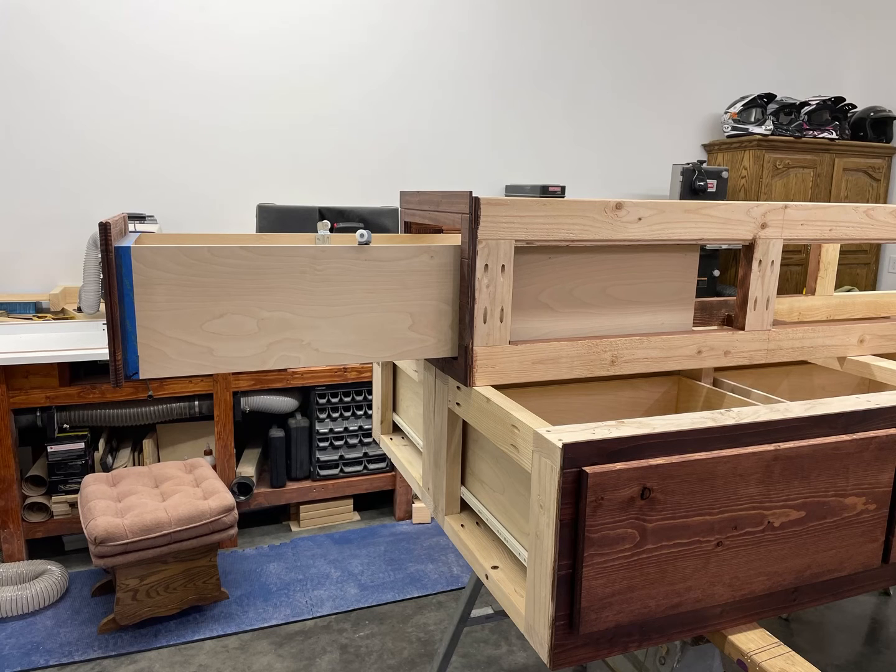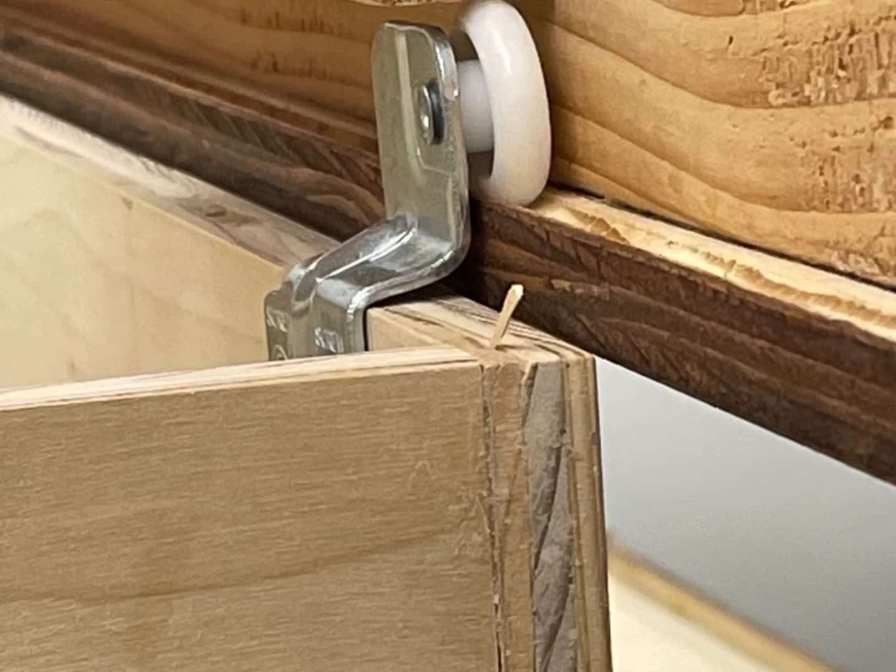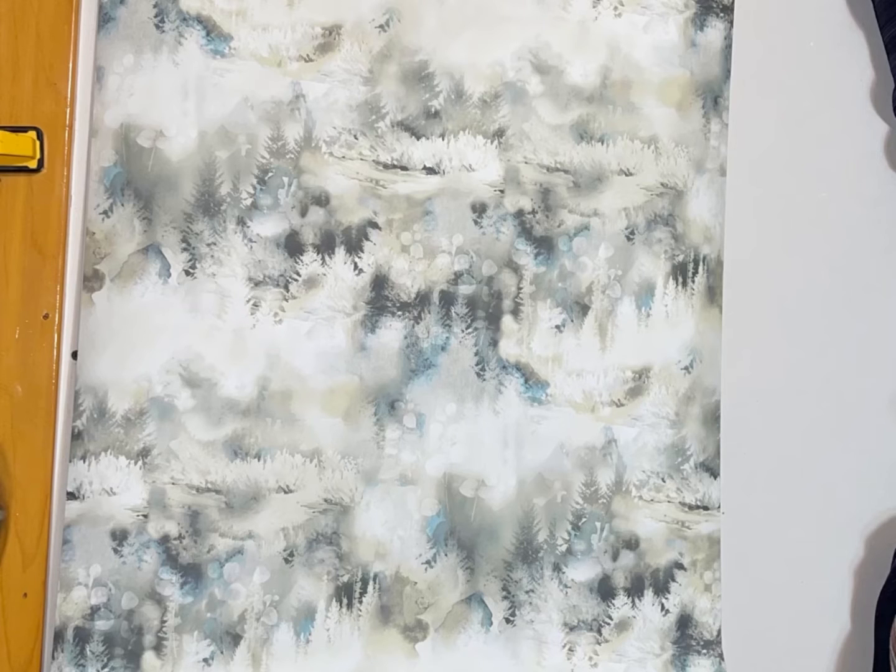This here shows I used some of those rollers used for a sliding closet door. I couldn't really figure out what to use for drawer slides on this four-foot-long drawer. So I used the router bit and made some grooves for those wheels to sit into. A lot of playing around, fine tuning, and adjusting them to get them just right so it didn't bind and pinch — but we got it, it rolls really nice. Not quite as nice as a regular drawer slide, but pretty nice all in all.